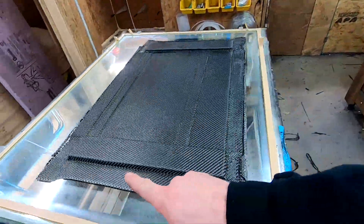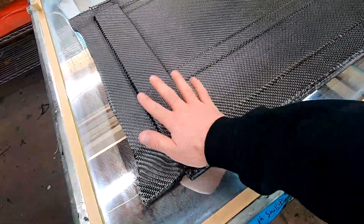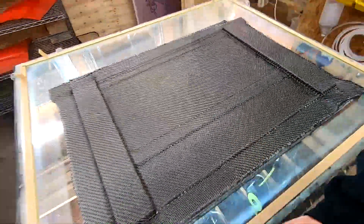Stopping the time-lapse so you can see what we have. This first hump is our first layer of SORIC core material. These are the foam blocks running down the sides, and I put in little extra ribs — so this is SORIC on SORIC. A layup like this is more technical than it needs to be; if you have more room or just want a flat panel, you don't really need all these core materials. I've done cores on cores before but nothing quite like this. Working on my own car, I try stuff out to see if it works, and then maybe roll it into new or upgraded products. There's always something to learn in composites.